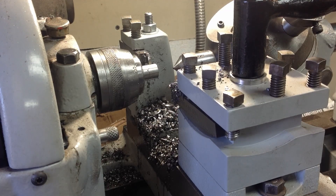For this product, they go to a second op where there's still a little nubbin after it comes off here, but that's machined away automatically on the second operation, so it's not a concern. All I did on this is adjusted the length basically, and adjusted where the cut-off tool was a little bit.